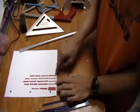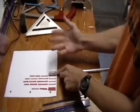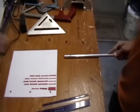You've got to remember that the bottom and the top are going to be a 90 degree cut. Everything else is going to be at 45. So line up your aluminum, make your first cut line, and then make a 45 off of that. You want the longer part of the 45 to be where your mark is. This is when you're going to want to use this triangle right here. I'll let you take a look at this — that's what your cut's going to look like.